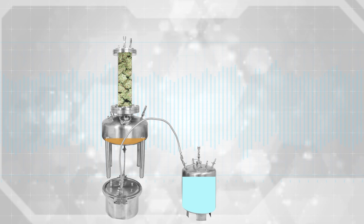Step 6: Draining into the sucker dryer tank. Just prior to recovering all the solvent from the extractor tank, use what's remaining to drain your extract into your sucker tank where the final phase of recovery can take place, after which the tank can be relocated to another work area where it can be dried down to 0 parts per million readings of any trace solvent.